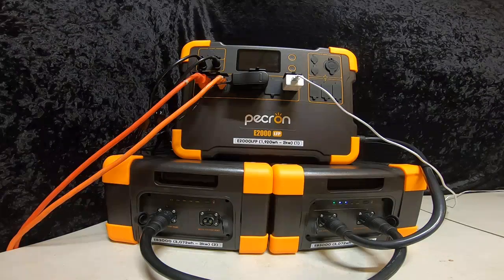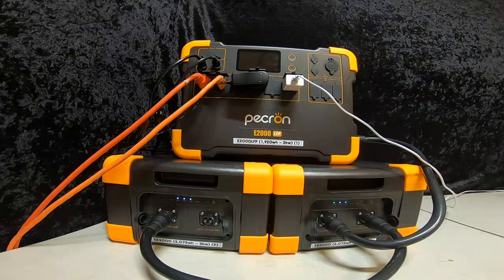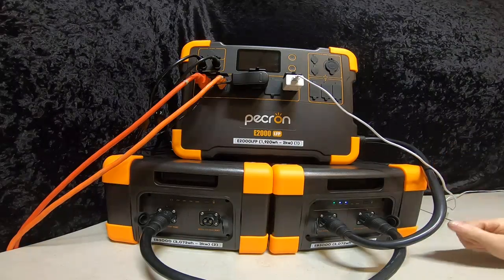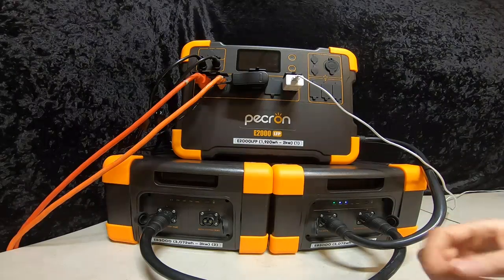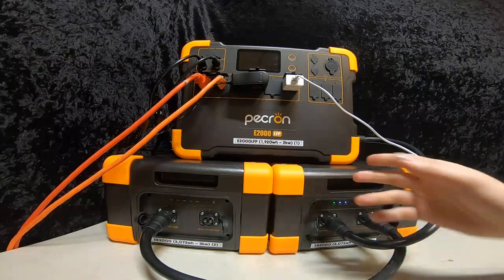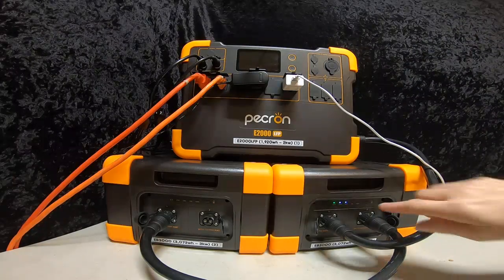Leave a comment. What do you guys think? Do you guys think these meters are just missing in action? Do you think it's the cables like Kilo M had mentioned, that PECRON mentioned? But I have a problem with that, because when you disconnect these cables, these batteries should reset, obviously, because they're independent now, right? They should reset to what they really truly believe themselves to be as far as the power meters with their shunts and their BMS and everything in there. But that's my question. Other than that, like I said, system works fine. I've had zero problems with it other than these damn lights.